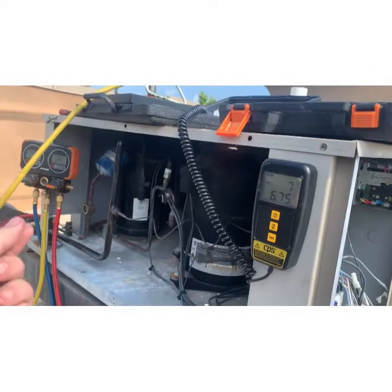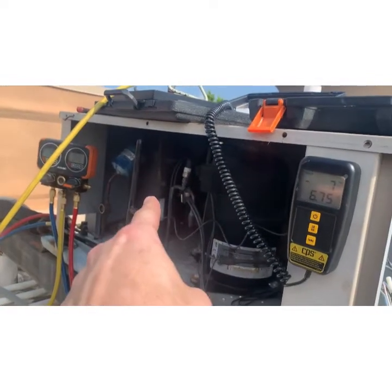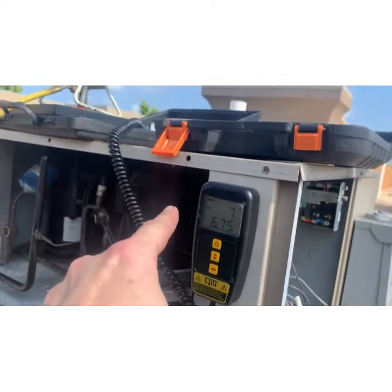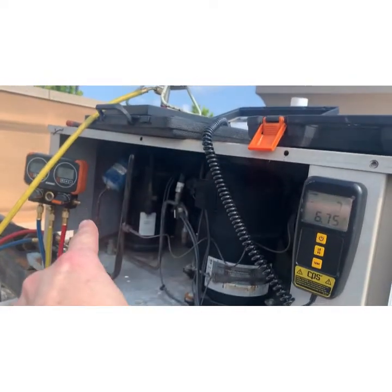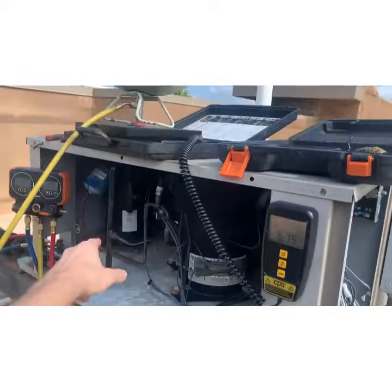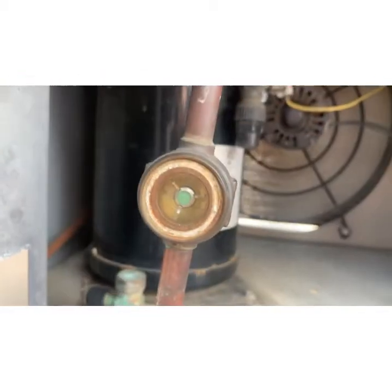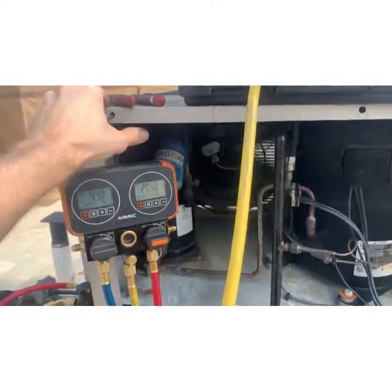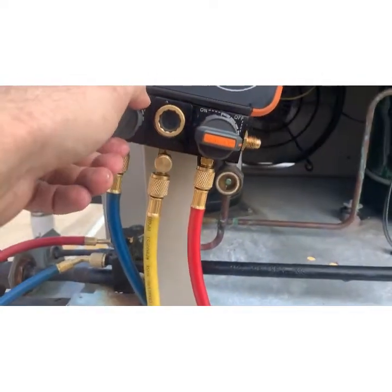So it starts out, you know, wide open, and then says, oh, I've got too much, it shuts out. That's why there's a receiver. So there needs to be enough Freon in the condenser and the receiver so that always there's a solid flow of liquid, which I can see in the sight glass now as the TXV is getting dialed in. We're flashing again. That's to be expected when you've got a system like this that was off and now you're letting the TXV catch up again.